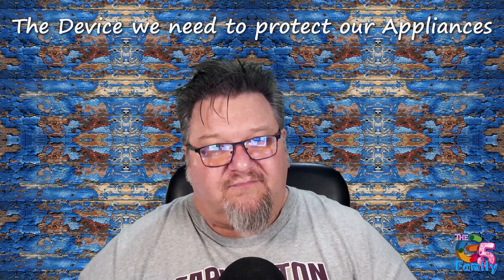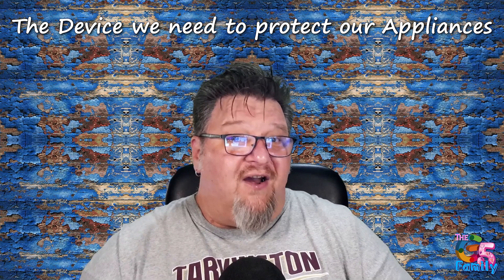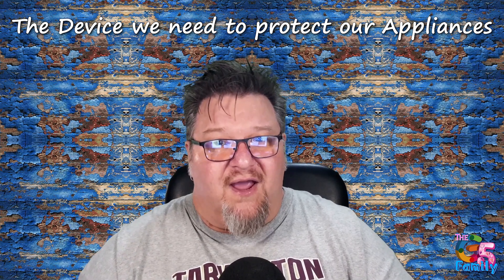This brings me to my third recommendation, and this section is a bit longer because we're talking about a long-term setup. When we first moved into our house here, I was very uneducated on the challenges I'd be facing. I learned that it is most common that houses will not be grounded. Grounding is sort of an overflow for extra power — think of it like the little hole in your bathroom sink that keeps water from overflowing. Here in the Philippines it's apparently not required in the code to ground the electrical system, so when the power surges there's no place for the excess power to go. You'll actually feel a mild electric shock if you run your hand across the refrigerator or touch the back of your stereo — not enough to hurt you, but definitely weird.